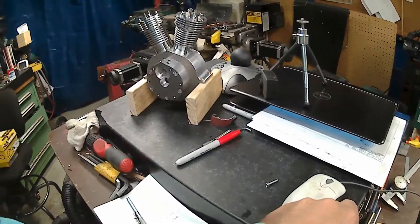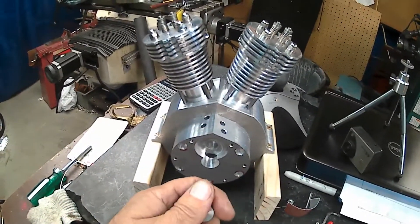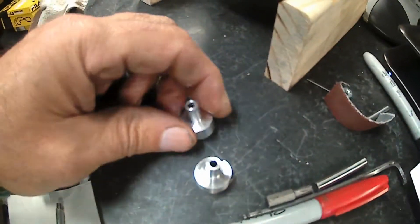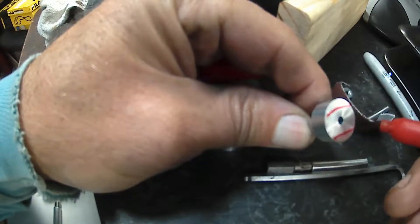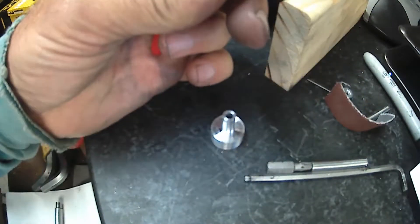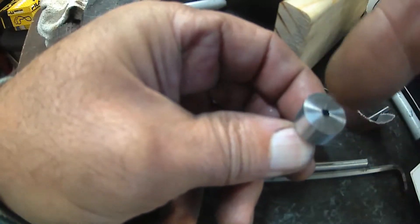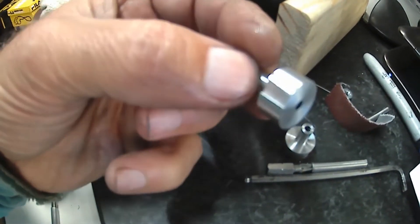So this morning I'm working on the little rocker arm standoffs. What I did was figure out what diameter I needed to encompass the whole thing and turned up a couple of blanks. Now I'm going to go over to the mill and mill this down to quarter-inch wide and quarter-inch on the back, then drill the holes through — one more part done. I'm planning on putting in a 5C collet block, setting it up, and cutting it.